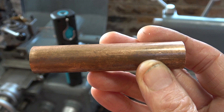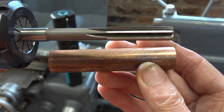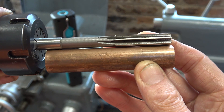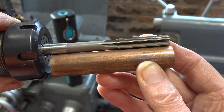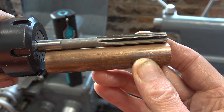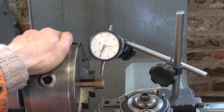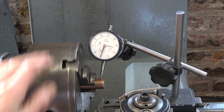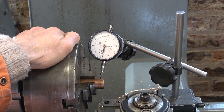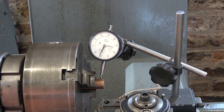That's now machined to length and drilled out at 9.5mm. I'm actually thinking I might just get away with it — this reamer's just about long enough; I just don't want it to bind inside and seize up. This way I could possibly do it in the three-jaw. Actually, with a bit of messing about I managed to get it quite accurate in the three-jaw — this gauge is in hundredths of a millimeter, so it's five hundredths of a millimeter deviation, which is two thou. That's okay. I'm going to try and get the reamer all the way through.